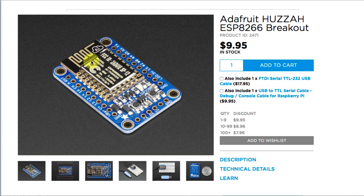Finally, there's a very inexpensive chipset, the ESP8266, which you'll find in a whole lot of Internet of Things applications. It provides you with a microcontroller with built-in Wi-Fi capability. These things in quantity one already on the breakout board are under $10, and the actual chipset is about $2 each. So that makes the Internet of Things a very affordable thing to implement.